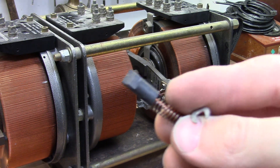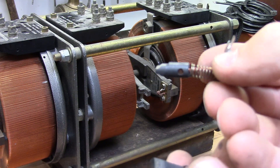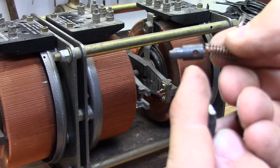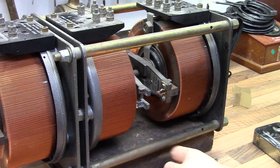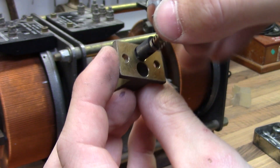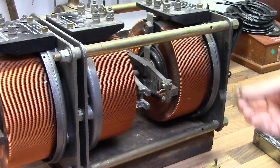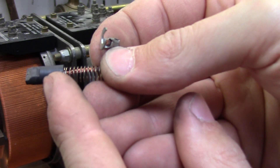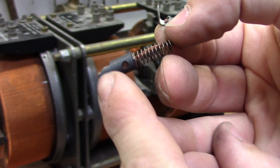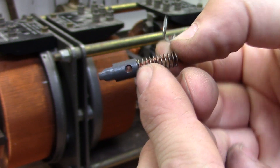As you can see, they've practically spent — they've got about three or four mil on the end of actual brush. That narrow bit is what you're looking for. But because of the shoulder here, it doesn't actually allow it to push through the brush holder, which has slotted holes down one end and round holes down the other. So when the brush goes through, it only allows it to go that far. What I'm going to do is extend that shoulder back a bit so we get a little bit more — I want to use it at the last three mil.